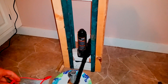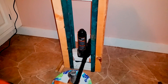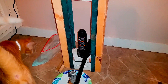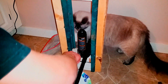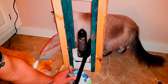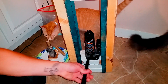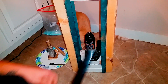Alright, take our teaspoon, dump an increment in, one more scoop — a little funnel would be nice, we don't have one at the moment. Kind of get that off the edges. Take our first rammer, place that in, tighten with hand pressure, and we're ready to press. Okay, so we're ready to press our first increment. We're going to make sure the hydraulic press is tight and sealed so it will pump up.